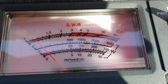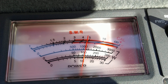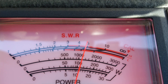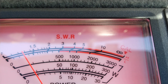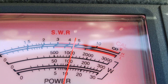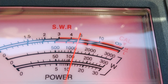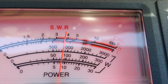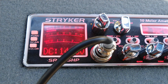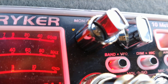The amp's also cold — it changes when it warms up. But on this meter I think we can comfortably call that 120 watt dead key right there. According to this meter it's probably more on an actual good meter. So that shows 120, and that was off of what this meter shows as a three, three and a half watt dead key. Don't have the RF power opened up very far. This meter reads low — this amp does a lot more than it's showing, but I just leave it in here.